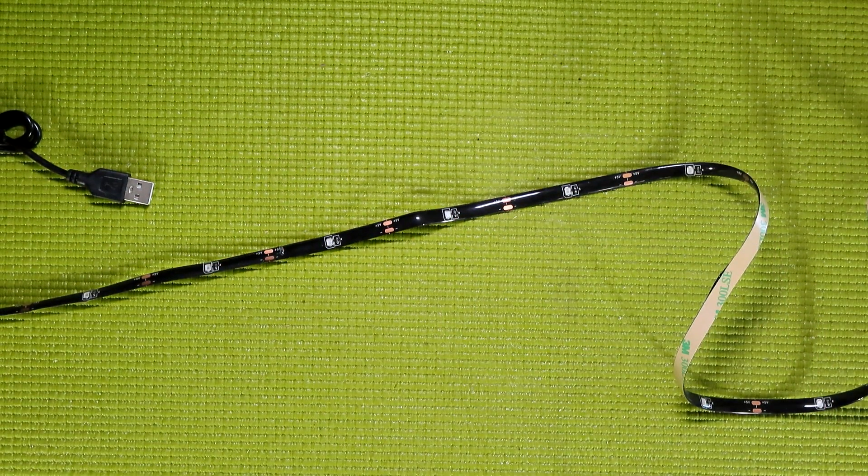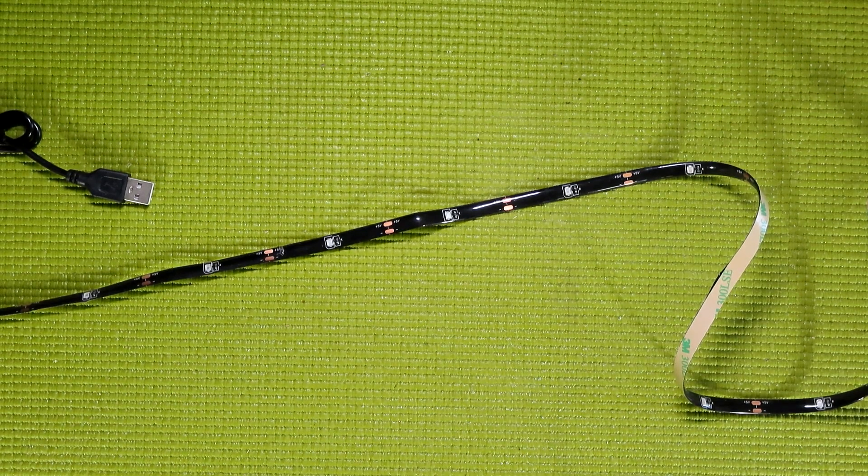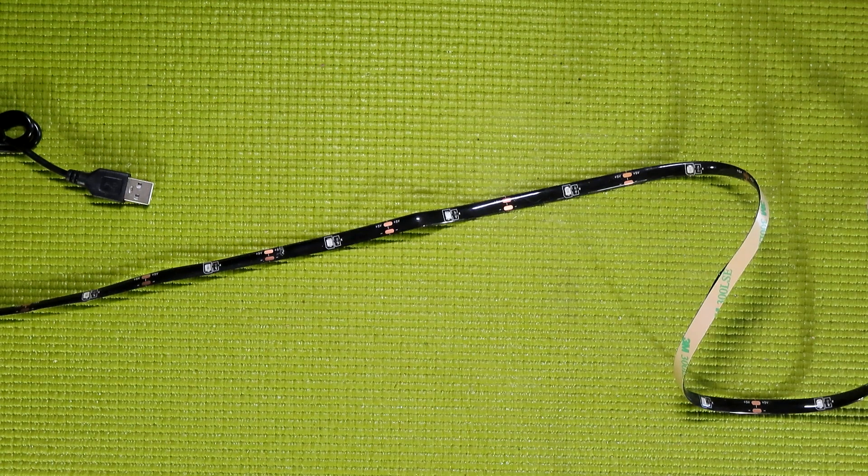Keep that in mind when modifying LED strips from 5 Below. Now let's talk about that blacklight effect, because that's really the main reason everybody's going to be buying this strip. Blacklight refers to the fact that these LEDs output light on the ultraviolet spectrum, which is typically not visible to the naked eye. Most blacklights do sprinkle in a little bit of purple or violet for extra punch. The UV light used here is UVA, which, as the box stated, is in the 390 to 400 nanometer range. So you don't really have to worry about any of the negative effects associated with ultraviolet radiation — that's reserved for UVB and UVC.